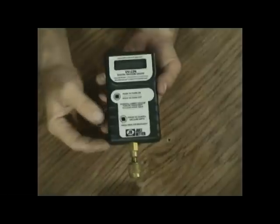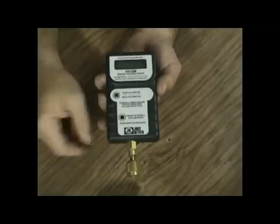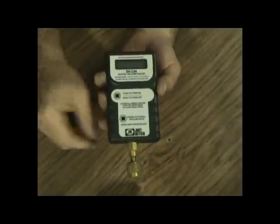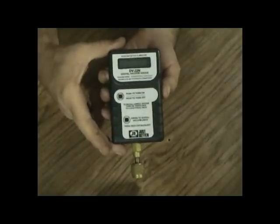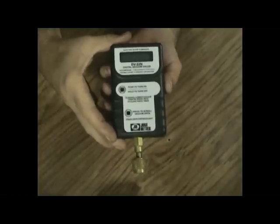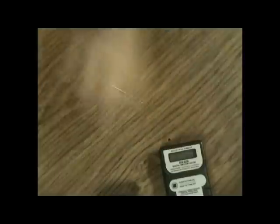The JB DV22N — JB's vacuum line uses the 'DV' prefix, standing for Deep Vacuum. It's thermistor-based with different resolution, and it does have an auto-calibrate that fires every 10 minutes, which is either good or wildly frustrating — if you glance at it and it says 'one' while calibrating, that's a pain. It auto-calibrates, but you just don't know if it's right. There's no real reference like on the Thermal, and when the sensor gets dirty, it doesn't know — so you can't tell if a slow pull is due to oil, sensor contamination, a leak, or moisture.